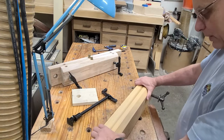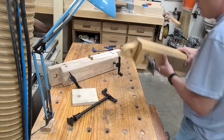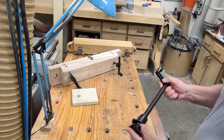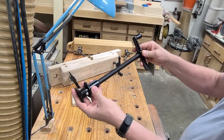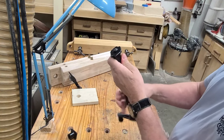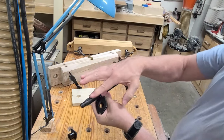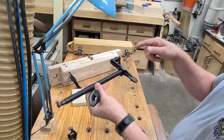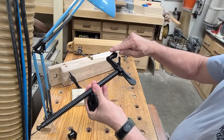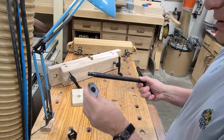This kit probably took me about an hour and a half to build, from rough lumber all the way to finished vise. Now I'm going to show you how to use this Pony Jorgensen veneer press screw. It comes in three parts — there's a little foot you can toss away, a threaded coupling with inside threads, and a 12-inch threaded rod that rides through the coupling with a t-handle you can spin very quickly. This is the guts of the system.